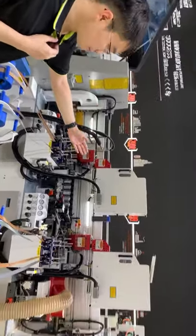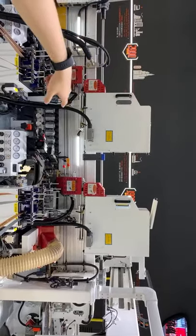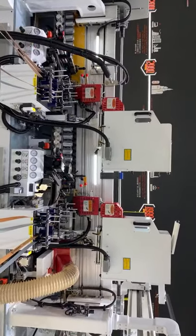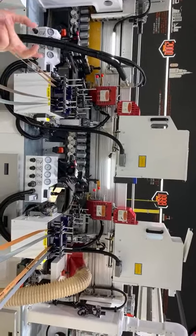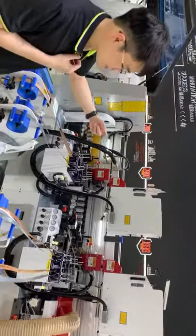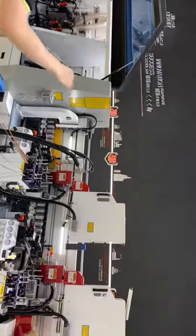We also use a pre-melt system. The pre-melt system allows us to pre-melt glue in the top unit, after which the glue flows down to the glue pot and edge banding is performed directly. Using the pre-melt system prevents the glue from carbonizing. If the glue carbonizes, the color turns black — white glue becomes dark color glue — making the edge banding result worse than normal. That's why we equip the machine with two pre-melt systems on top.